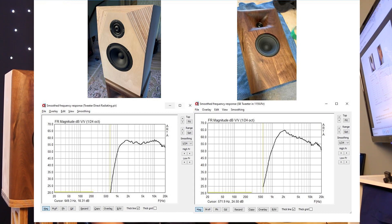Let's go right to the measurements. You can see a direct comparison in the frequency response. You may be startled at first — this is totally expected. A horn normally provides a 9dB boost in sensitivity at its cutoff frequency. In this case, that's 2kHz, so you can see 2kHz is 9dB higher than the regular test baffle, followed by a nice gradual falling response above that. This is the transfer function of the horn, and because the SB tweeter is so flat in its response, the horn's effect is very clearly visible.